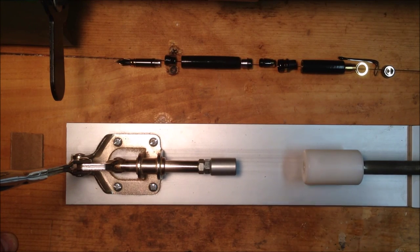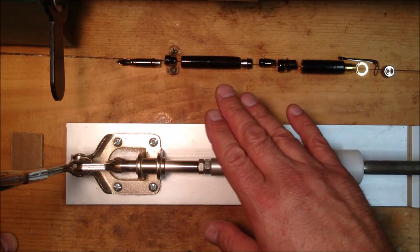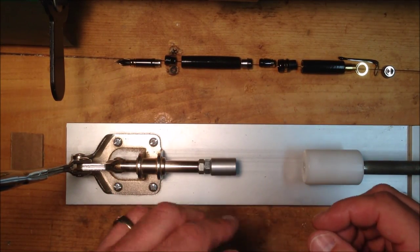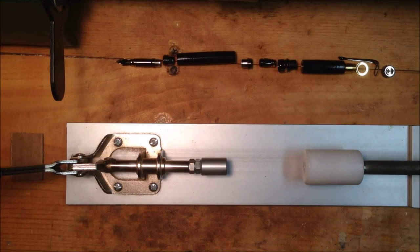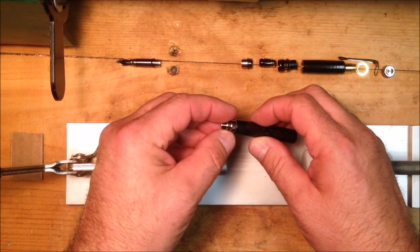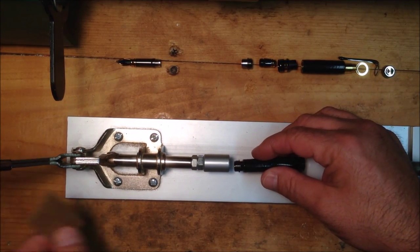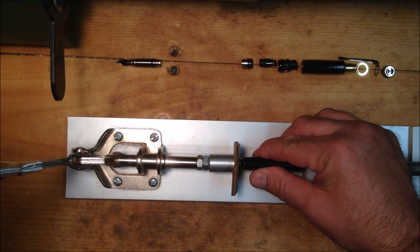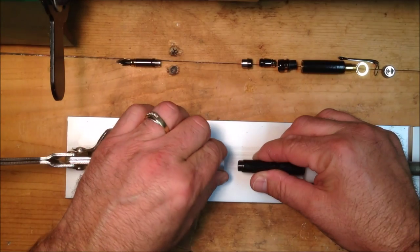I'm ready to begin assembly on my pen, and since this is the first fountain pen I've ever assembled, I've gone ahead and laid the pieces out in order so that I know what's what. I'm going to follow as closely as possible the instructions that came with it. The first thing we want to do is put a coupler in each end of the lower barrel — these just slide in. I'm going to give it a little tap just to kind of get it started, and I like to use just a piece of corrugated cardboard to protect the coupler from the aluminum piece that presses it in.